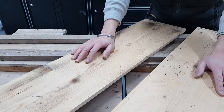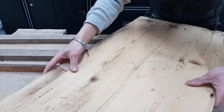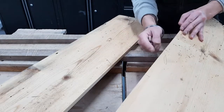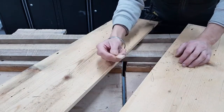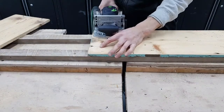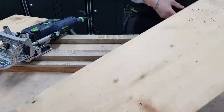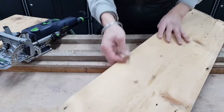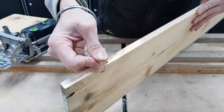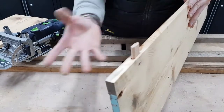I've made it higher now and just by gaining 100mm it's made a massive difference. With the lift-off hinge in place, I'm sat normally and my knees go under the desk, which is great — really happy with that. The base was made up of two pieces of timber and I've sanded it down. I'll cut a clean edge on one side so when I come to glue and screw them together they'll join really nicely without leaving any gaps. I've cut the slots and joined them together using dominoes.